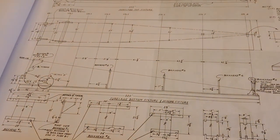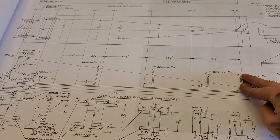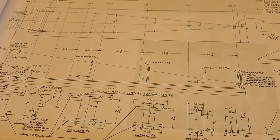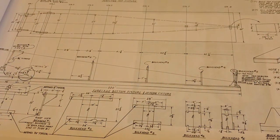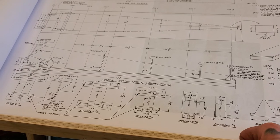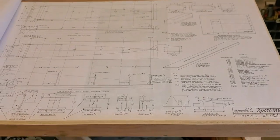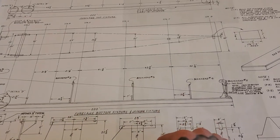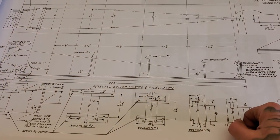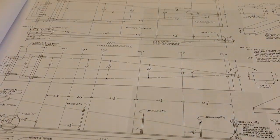The one thing I read online is that as long as your tail is square and lined up with your wing, everything in between doesn't really matter that much. I'm not saying you can go willy-nilly with no attention to detail and put a big curve in your fuselage, but realistically as long as the tail post is lining up with everything else, your horizontal stabilizer is flat and level, and at the correct angle of attack relative to the wing — it should fly all right. So I'm not too worried about this little block detail.